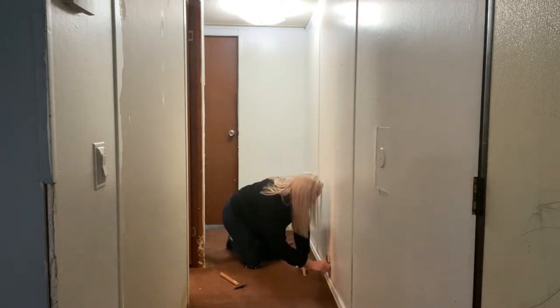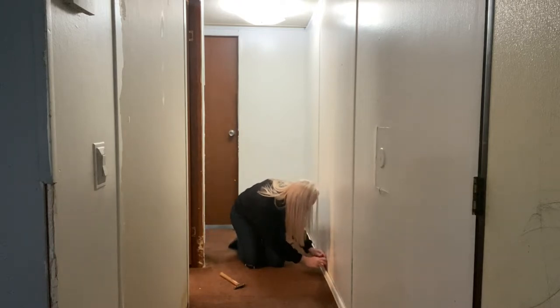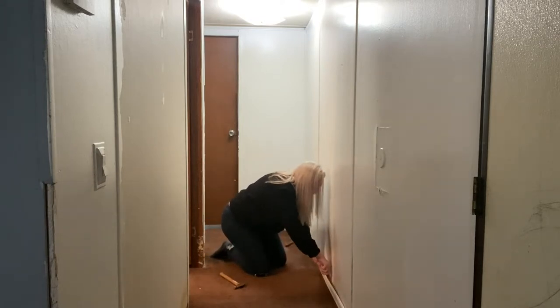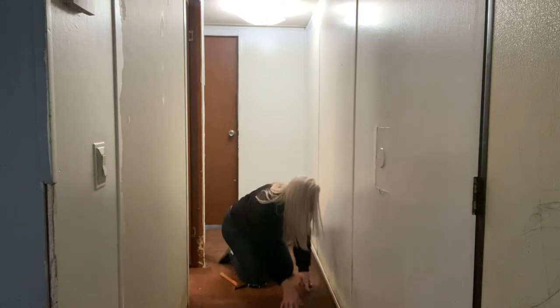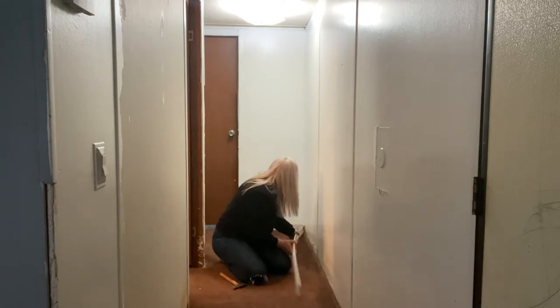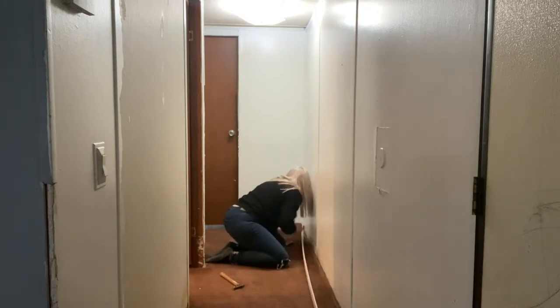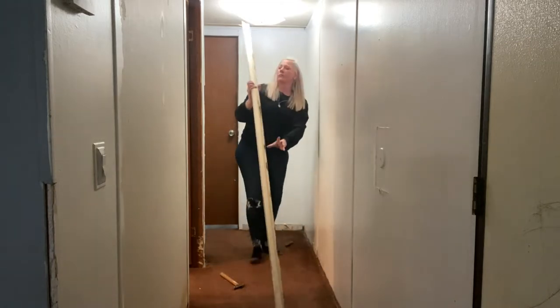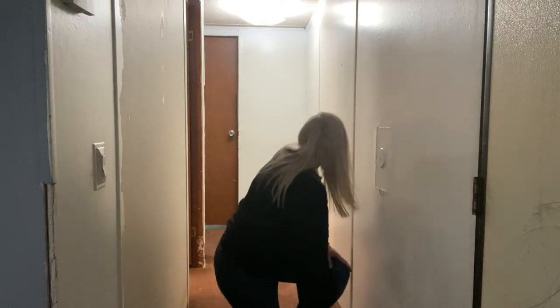This is something I have been wanting to do forever, but every video and tutorial I've seen of people doing it themselves, they were always just putting it over linoleum or vinyl flooring already. I hadn't seen anybody in a mobile home actually have to rip up their carpet and try to lay this, because mobile home flooring is particle board or OSB, and most vinyl planks say they will not stick to particle board.